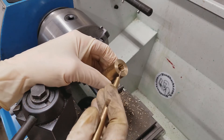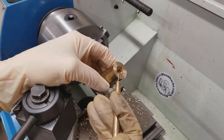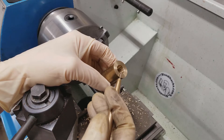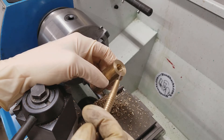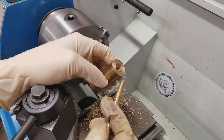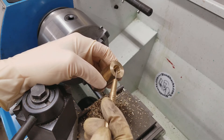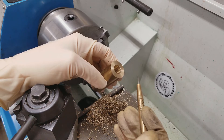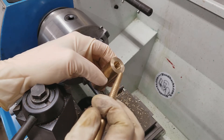That is how you make a precision hole on the lathe. Because we used a 500 thou reamer, we can be confident that this hole is 500 thou. If you need it a little smaller for a press fit, or a little larger for a free running fit, you can get over and undersized reamers — half or 1 thousandth over or under the size you want. Now, you might be asking yourself: why would anyone go to all that trouble when you can drill a hole on the drill press or using a hand drill? You drill things on the lathe when precision really matters — not only the dimension of the hole, but also when you need that hole to be extremely concentric to the stock and extremely square to the face. If there's going to be a sliding mechanism involved, like a piston, valve stem, or anything running in the shaft, you need it to be extremely square to the face. If it's part of a larger mechanism — maybe a bushing or a bearing — you need it to be very concentric to the outside surface. When precision matters in all dimensions, you do your drilling on the lathe.